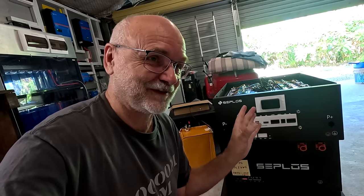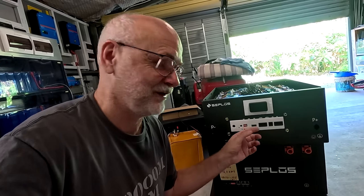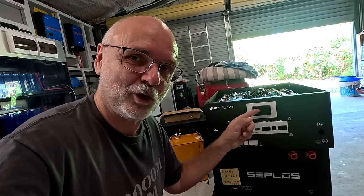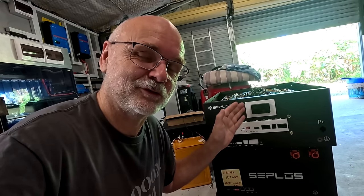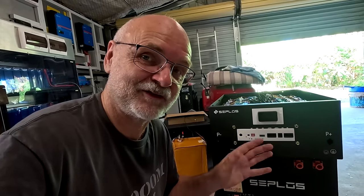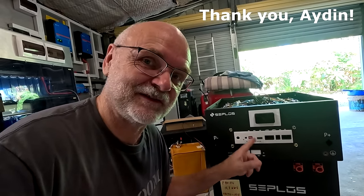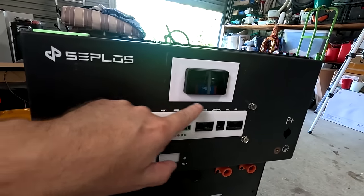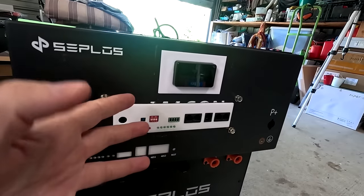So far, this video is about upgrading the Seplos battery with the JK BMS. As you could see, it requires a bit of mechanical work, but we now have all the templates — the BMS carrier, the display holder for the small display for this smaller box, and a cover for the original communication port cutouts. I'll link all the 3D printing files below the video — everything is on Tinkercad, you can follow me there and modify the designs as you need them. Except this one — that's from Thingiverse — that guy made it and I just reused his design.